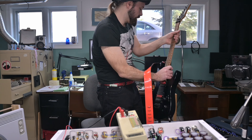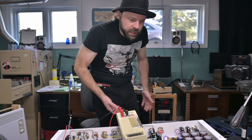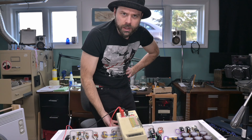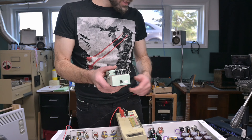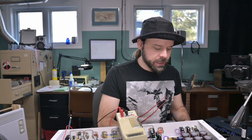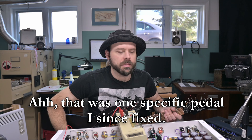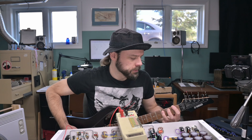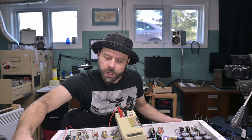We added like 100 millivolts going from the 3-something to the 470. Let's try it once again with the effects pedal — the effects pedal that oddly boosts signal. I think it's behaving consistent with the way it was before. Even though it might not be all the way down to negative 10 dB, the pedal's liking it. The only thing is, the stupid pedal has volume issues — I've got to go try another pedal.